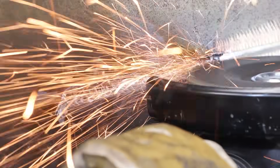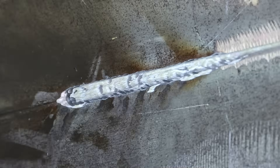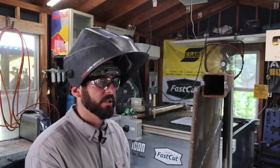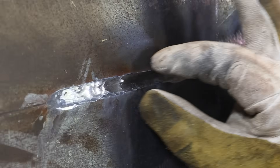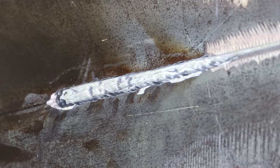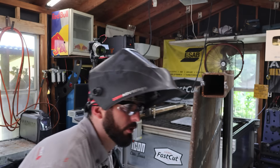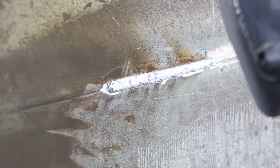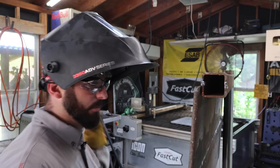I'm trying to match it to this grind. At the end of the day, I'm still looking for that line running through there — it looks like I got it. Anywhere we touch with that plasma cutter needs to be more than just wire-wheeled; it needs to be clean. I can see that the bevel is getting wider and wider — my groove got wider and wider. That's something you don't want to do; it's going to require more work down the road. We want to get some depth into it. I could have tightened up my pattern and maybe turned down my amperage a little. After a bit more grinding, I see a little bit of that line, so just make sure you get all that plasma-cut residue off before we switch settings.